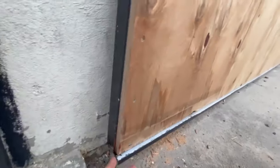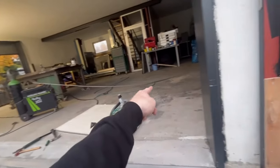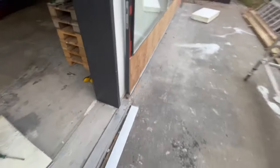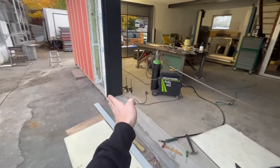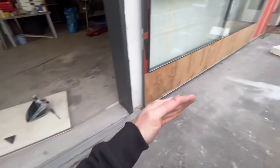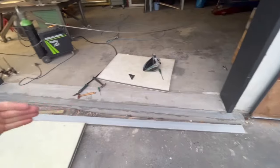This profile is now welded on with a few points. I'm going to glue this one on the top here and slide the door over it, then weld that one with small points. It's really important that this one is straight and on the right place in and out. I'm going to weld this together - everything a little bit when everything is closed on a straight line - and try to make it open and close smoothly.